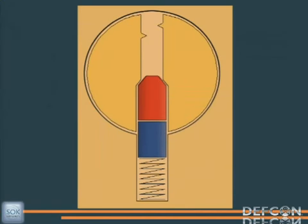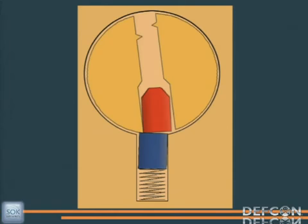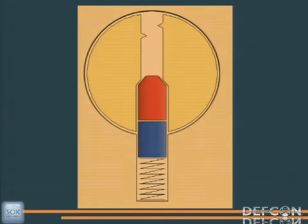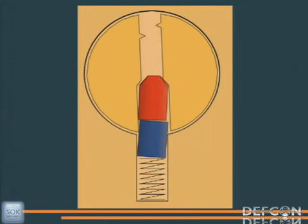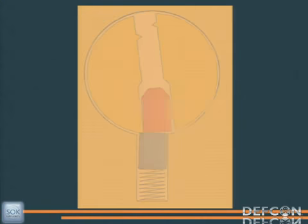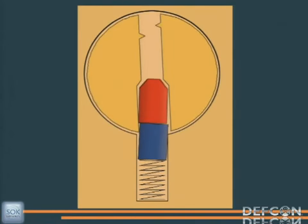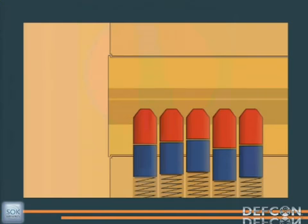And that's because it's not turning because the blue bit is in the way, and if we do put that pin stack down, then the cylinder will turn just a very slight angle, until the next blue bit starts preventing it from turning. But the neat part is that now this blue bit won't be pushed back by the spring because there's bits of yellow in the way. So that's cool. So what we can do with that is picking a lock.